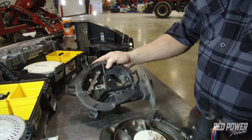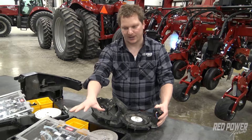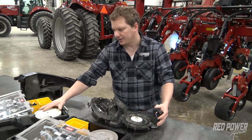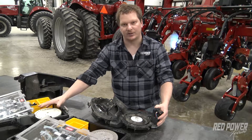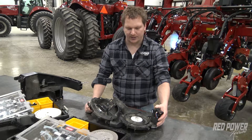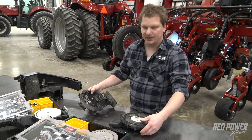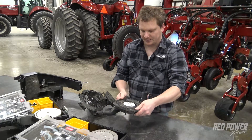So we're going to lay these two meters out, and you've got two kits from the Red Power Team. You've got a soybean kit and a corn kit, and each one of those has their own discs and soybean ejectors. We're going to walk through installing them. The first thing we're going to do is install a corn disc in this meter.